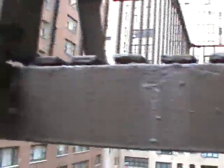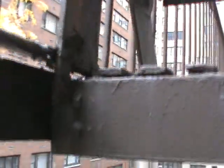My concern from the 7th to the 6th, which is here, is that some of these have popped. Let me show you where they've popped. So you see this connection here that's holding the staircase? It's already fallen. So this is a life safety issue. So number 7 coming down on number 6 is a life safety issue right there. So we need some emergency repairs done first.